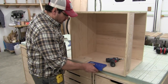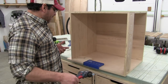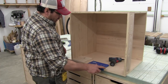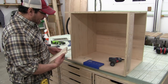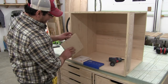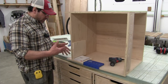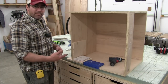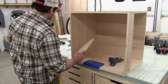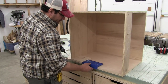I'm going to drill some adjustable shelf holes. I'm using this little Kreg jig, a 5mm bit, and a stop collar. I'm keeping the bottom of the jig 165mm off the bottom of the cabinet. The reason I went with 165mm is that I might end up building a drawer for some CDs, so if I gave myself 18mm spacing for the drawer, there's still enough room for it to function if this bottom hole was used for a shelf. Pretty straightforward — just hold the jig and drill some holes.